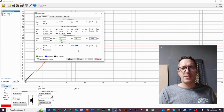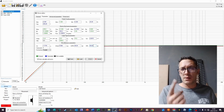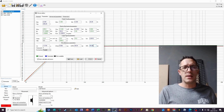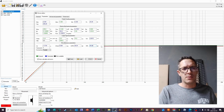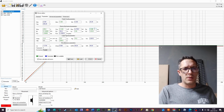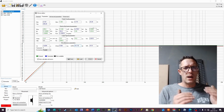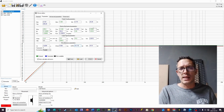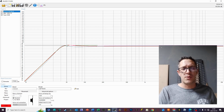But what I want you to look at over here is that there are 2 values for SPL. There is USPL and there is SPL. It might be confusing because we've spoken only about one form of SPL, but the secondary level of SPL is quite simple actually. We are looking at 3 8-ohm speakers, nominal impedance of 8 ohms. However, we have a DC resistance, which essentially is the lowest impedance your amplifier would see. If, for example, our lowest impedance was 3, and we click somewhere over here, we can see that our overall SPL is changing slightly, specifically our USPL, because it's now looking at the minimum impedance. So while you might see a difference in those 2 SPLs, simply put, it's looking at the lowest impedance. I'm just going to cancel this, we don't want to save any of that. So based on our nominal impedance, WinISD is giving us some form of loudness.